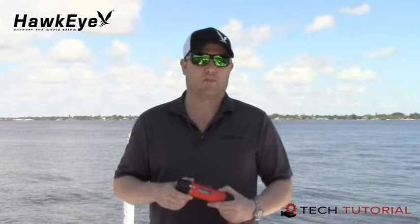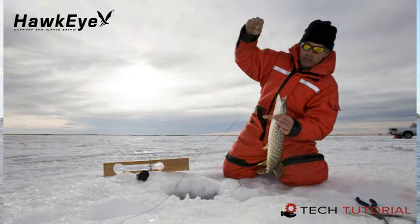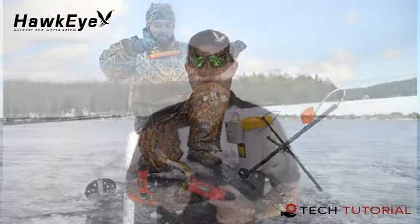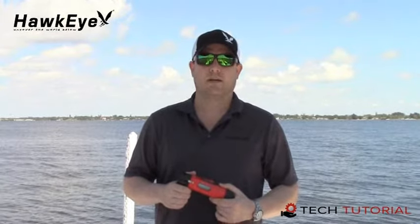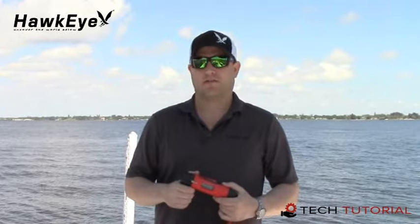Please refer to our website for more advanced instructions. The Deptrax 1H can also be used for ice fishing, allowing you to see the conditions under the ice before spending time augering your hole. To shoot through the ice, clear away snow to expose clean ice. Place a small amount of liquid water on the ice and set the transducer on the water. If there are any air pockets between the device and ice, or the water below the ice, the device will not work properly and will require you to try another spot or cut a hole in the ice to use the device.